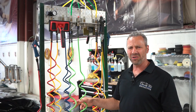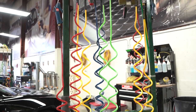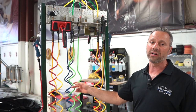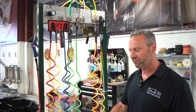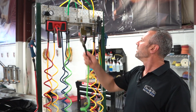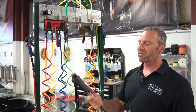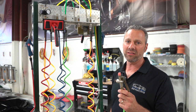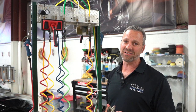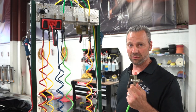We use coil hoses. Coil hoses can be tough because they tangle together, but if you keep them spread out a little bit it usually works all right. If guys take good care of their stuff, this is a good solution — I've never found anything better. If you use long hoses, they're never long enough and they coil on the floor and look like a mess. For guns, I like these all-metal guns. Plastic guns' handles can break — they're a little cheaper, but a high-quality unit like this works a lot better. We've got some with Viton seals, which are chemical-resistant seals that hold up a lot better. It's worth the money.